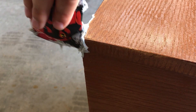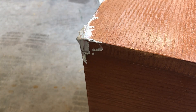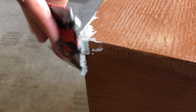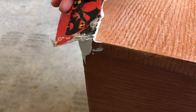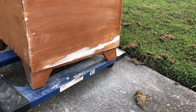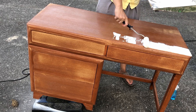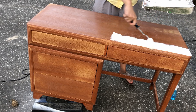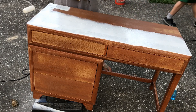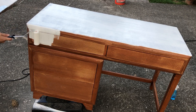I am using a playing card with Mr. Incredible on it to smooth out my Bondo. There were a few chips in the veneer at the top and then a whole piece came off at the bottom, and I just filled them up with Bondo, waited for them to dry, and then sanded it all smooth. Even though this piece isn't solid wood and it's just a veneer, it can still give me some bleed-through issues, so I went ahead and primed the whole piece with my bin shellac-based primer, which should hopefully seal anything in that would bleed through my paint.